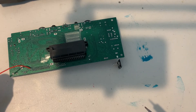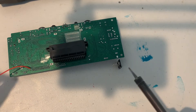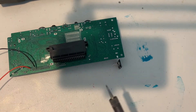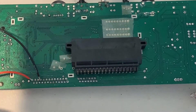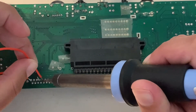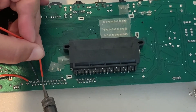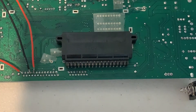The first wire attached here is the ground wire. The next wire we'll be connecting is labeled D2, right here. The following wire is labeled D3, located right next to the one we just did. I'm soldering using my non-dominant hand so bear with me — after I'm done I'll go back and make sure they're all secure.